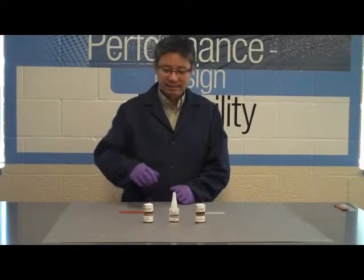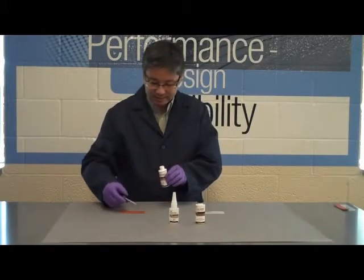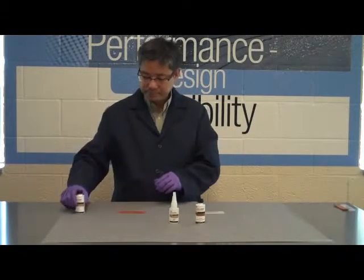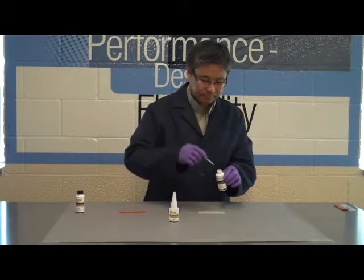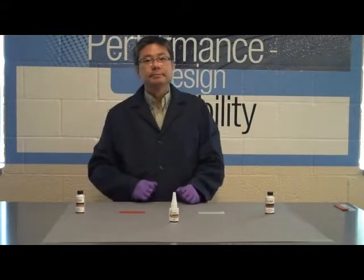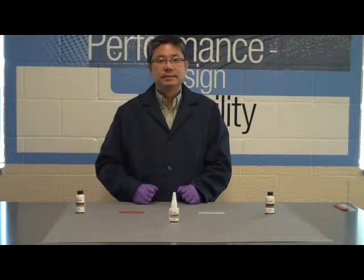In this demonstration we will be priming the silicone rubber with the primer used for elastomeric substrates, AC78, and priming the polypropylene with low surface energy plastic primer, AC77. It is important to note that the primer should be allowed to dry for at least 15 seconds before applying the instant adhesive.